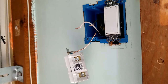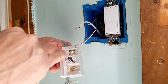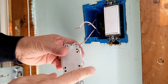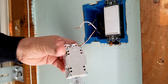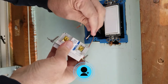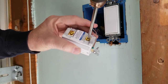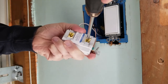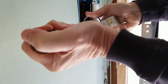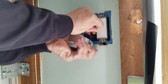Now we're ready to connect the ground wire. Knowing where our line is, we connect the neutral to the white side and the black wire to the brass-colored terminal. We leave the load side alone since we have nothing coming in there. We'll use the back connections as opposed to the side connections, then pull on them to make sure they're tight and won't slip out.